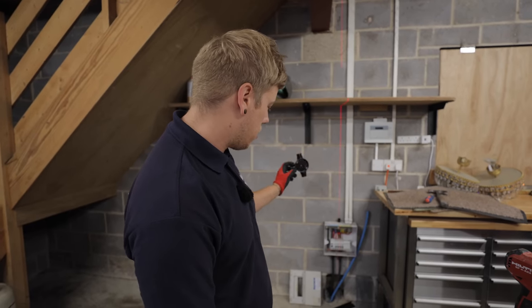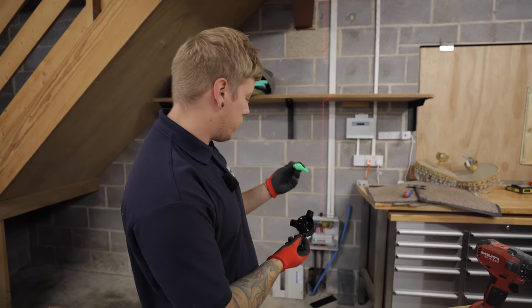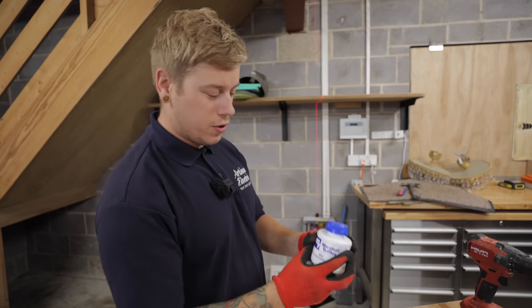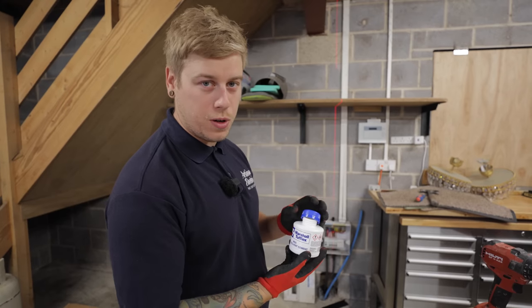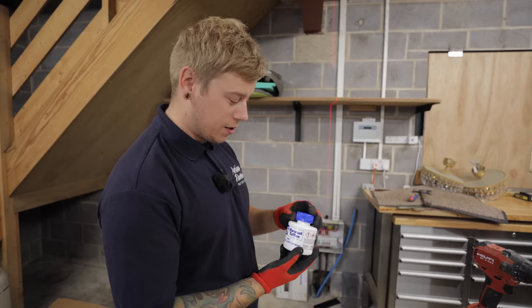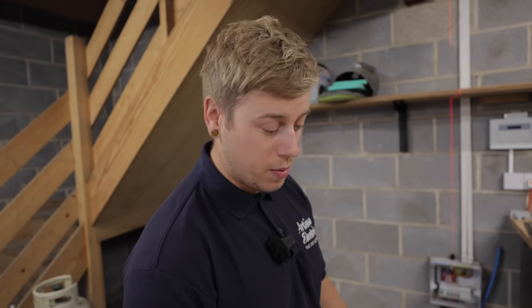We're going to get the T onto the coupler there, so cut just a little bit - that'll go into the coupler. We'll cement that down with some solvent cement. With our marksman we'll just mark on the wall and get that drilled up. I haven't used this stuff in years and it takes me back to my very first couple of years from leaving college. I did a long job on Harlow Hospital, me and a good mate of mine, just doing tube everywhere. Just the smell of that takes me back - it makes me feel old. Write in the comments below and let me know what your first job was.